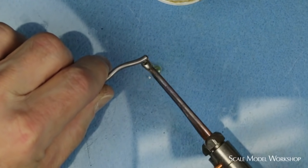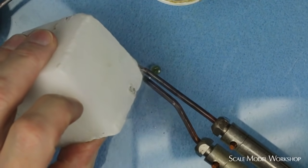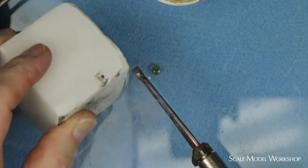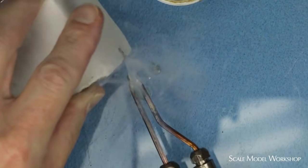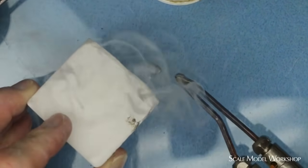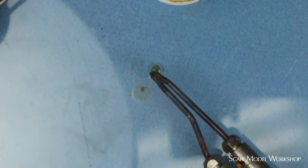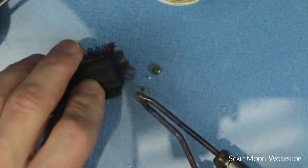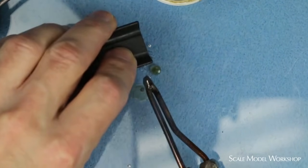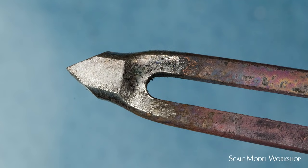In the case of a copper tip, the tinning process starts by applying some flux to the tip. When heated, soldering flux removes the surface oxidation from the tip and allows the solder to flow. A sal ammoniac block can be used to clean the hot surface and move the solder around. Any excess solder can be removed with a brass brush — there's no need to be flinging hot solder all over everything like magic dust. The soldering tip needs to be re-tinned from time to time, depending on the amount of use.